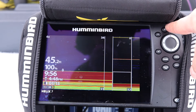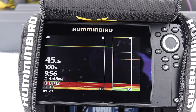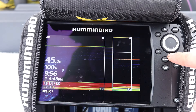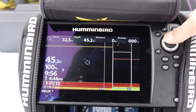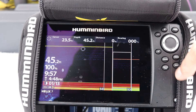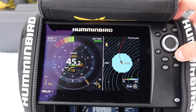So 34 feet and below at four times zoom, and you can adjust those. What you need to do to move the cursor — instead of moving the arrows — you need to press menu and then Show Cursor, and then you can go and mark something if you want. If I press Mark, it's going to give me a waypoint on my map. Once I press Exit, the cursor goes away.